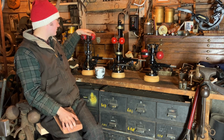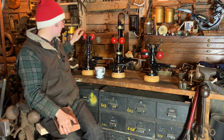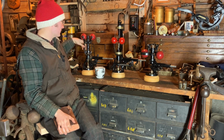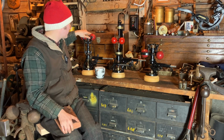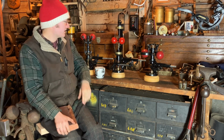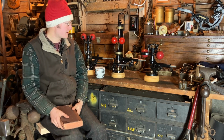And the Gardner operates in a very similar way, but the balls are held with these links and then you have springs. These are three leafs only on the bottoms. And again, there's a link in the center that as this, oh, I guess this is kind of inverse. As the Gardner operates, the balls come out, the central shaft is actually pulled up instead of pushed down like these two other ones and the gravity governors.